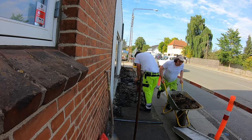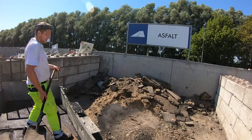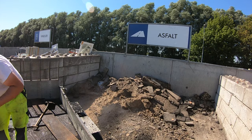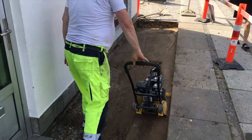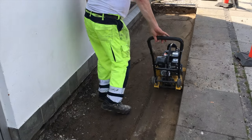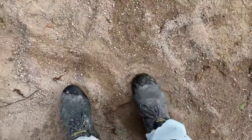And of course, a powerful car and a trailer. We start here by breaking the old asphalt and removing it to the recycling plant where we dispose of it in the right place according to our local guidelines. Then what I like to do after all the rubble is removed is to start by vibrating the soil with the plate vibrator, until it gets hard when going on top of it.